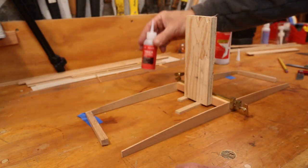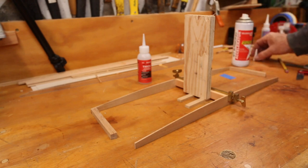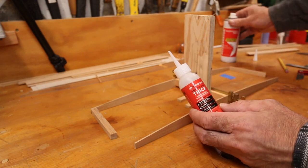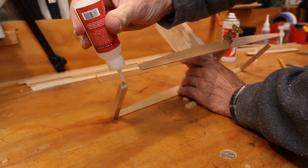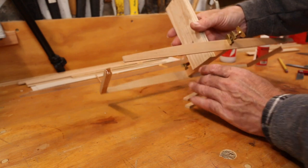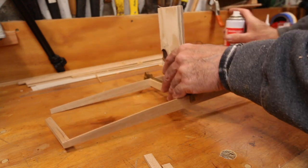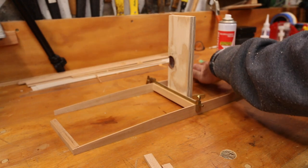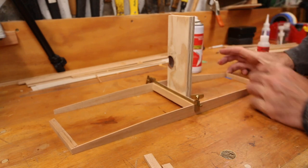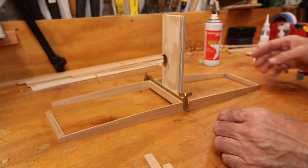And so this Starbond, I have specifically come to really enjoy. What I like about it is when you use the accelerator, it doesn't make the glue too hot. I think most cyanoacrylates are almost the same, but I find this particular one doesn't smoke up on you the way others do. That's especially useful if you're trying to use cyanoacrylates to fix little voids in a finish, so you get a dent in your varnish or something like that. You can fill that dent with cyanoacrylate and it will level out, and you can sand it flush and make that dent disappear. But the danger with doing that is that when you hit it with the accelerator, some of them tend to cure really quickly, and they'll smoke a little bit and you'll get this cloudy white finish. And I find the Starbond is really good at not doing that.